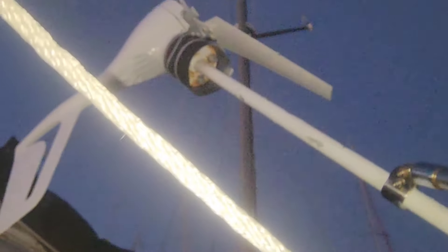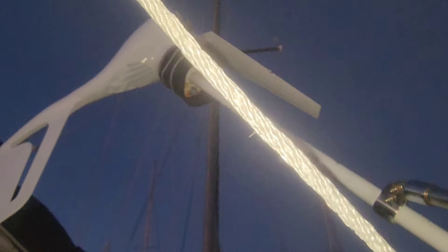There is no pipe die on the island to rethread that. So what I'll do is take the coupler off right here and just have this welded, then put them back up and rebrace them. So let me get to taking this apart.